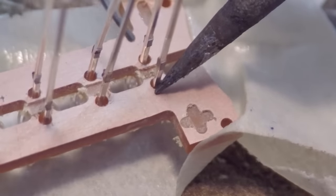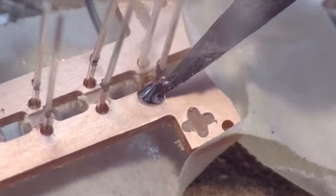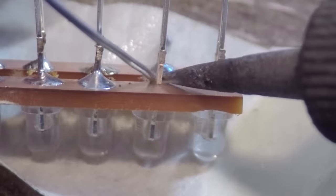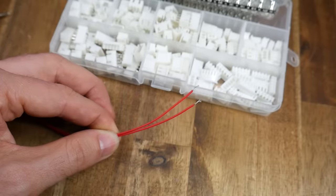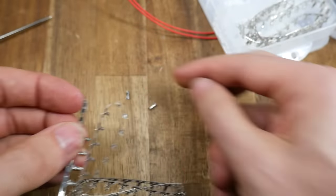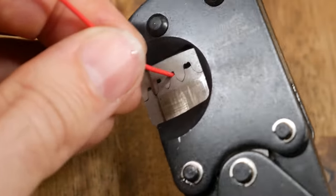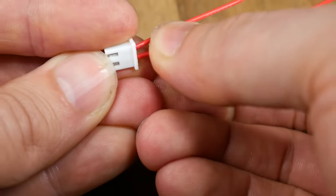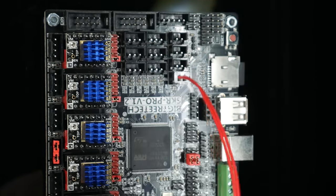Most people would be familiar with the process of soldering, where we use a soldering iron to heat up two components and then introduce solder, which melts evenly between them, creating an electrical junction. Soldering can be used on these machines, but what we're concerning ourselves with today is the process of crimping, where we strip back the ends of the wires, then we typically have a connector that goes into a crimping tool and is crushed down to mechanically grip the wire. Once the crimp is successful, the metal terminal then goes inside a plastic connector housing and the junction is complete.